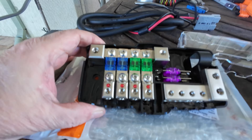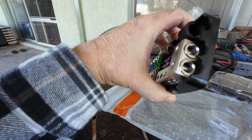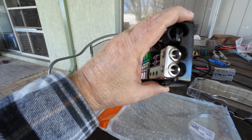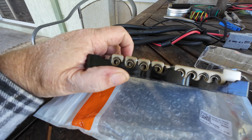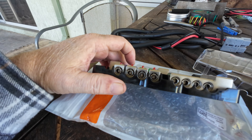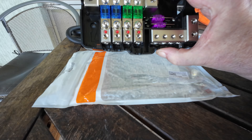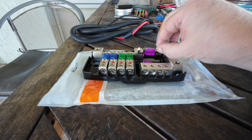These are really heavy — I'd say this will easily take 35-millimetre squared cable. It's already got wire retainers built in, so you don't necessarily need to use bootlace ends, although you can. Both sides have the retainers built in. The cable size looks like maybe 10 or 16 — I'll check what cable size fits and that's what I'll use. It's also got little indicator lights, so if any fuses blow, I'll be able to see and know I've got a blown fuse.